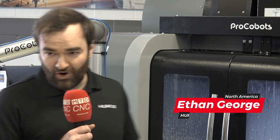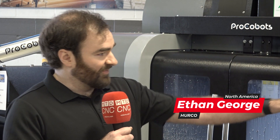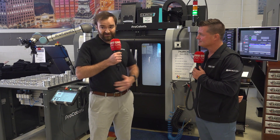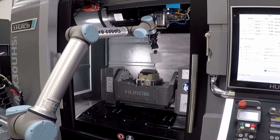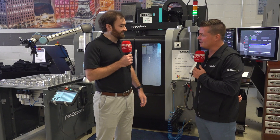Yeah, so our customers — a lot of them know CNC, they know Hurco machines, but they don't want to learn how to program a robot. That's where our system is great. Everything is right here on the Hurco control. We call it the Automation Job Manager — it's an auxiliary application. The customer never has to touch the robot program or the TeachPen. It's all right here: set your parts, set your part dimensions, set your part weight, and all those calculations are done for you. Set up the part in five minutes and you're running. It's that simple.